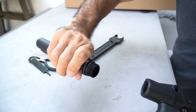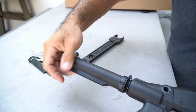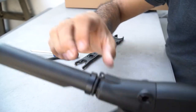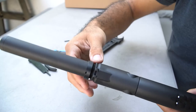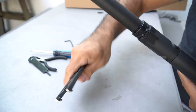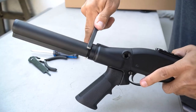The second seal is over here at the junction I just showed you. Since you already have it apart, you can inspect it as you put it back together. That's when you can tighten it — and if there's a leak there and it's valve-related, you can just replace the valve. Tighten this up until about where the O-ring sits, then slide your indexing plate in. As you tighten the castle nut, that'll push the O-ring in a little bit tighter. Hand-tighten first, then use the tool. Make sure the teeth line up, and give it a couple turns until it starts to look flush.